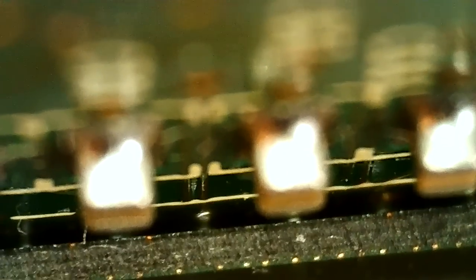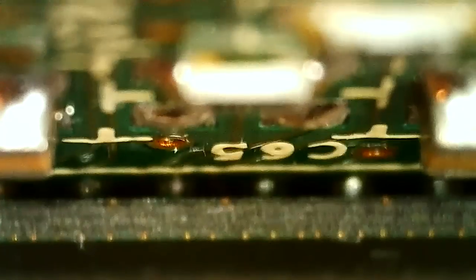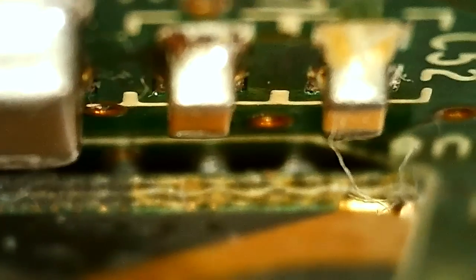You can probably heat up the card a little bit, so it's a little bit warm, to get the flux to be more dissolvable. Then you want to clean it with something, and I've seen people use compressed air. You have to be careful, obviously, have a regulator and stuff, so you can blow it out. I don't have that, so I used electronic cleaner from a can to basically blow out the Amtech flux before it solidifies completely. I took the card off when it was around 80°C and checked it. It probably cooled a bit more, and then I cleaned it, and it's gonna cool fast.